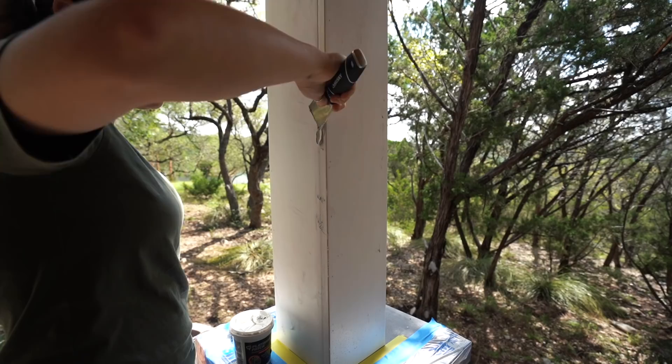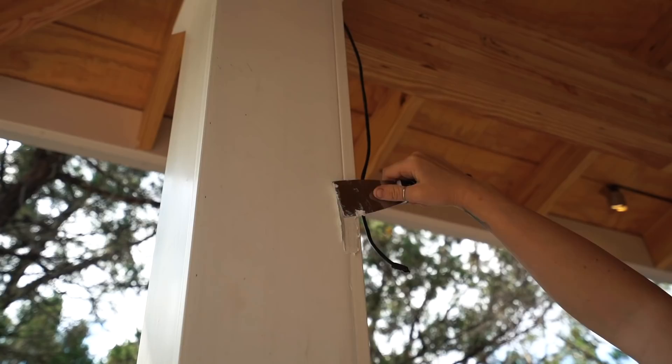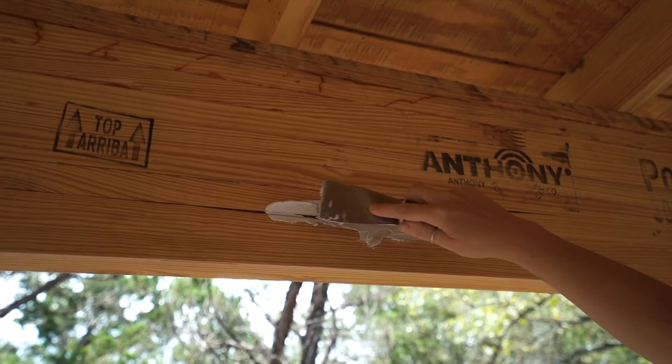The first category of tips is all about surface prep. You first need to go through and fill in all cracks and holes. Some people try to do this with paint but it's not going to give you the result that you want. For exterior jobs I like Dap's Platinum Patch because it's weatherproof and works with just about any exterior material — wood, plastic, composites, even concrete. Instead of having three or four fillers on hand, I only need one.